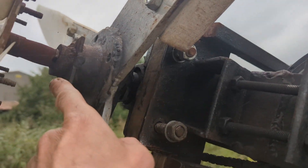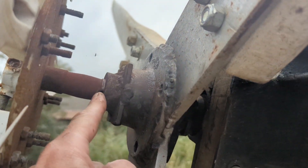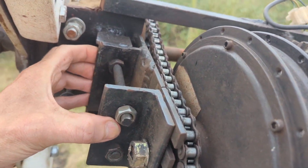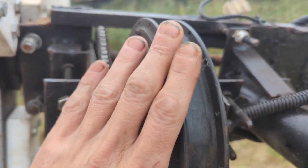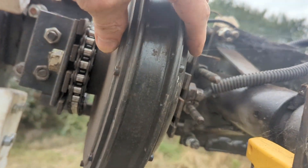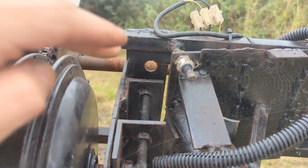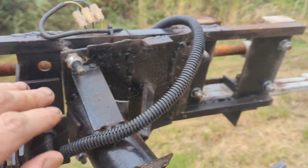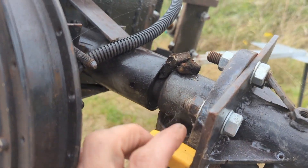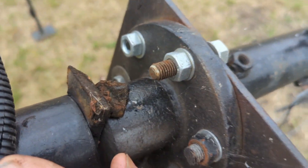This is the axle spindle, and on the front and back I've got those collars welded on. This is the device used to raise and lower the motor, which is here — what an absolute beast this thing has been. That's just a bog standard one kilowatt motor and it's not even very wide. There's the motor frame adjustment thing — I made this from scratch. It just fits over the top. I needed that because the bit which makes the turbine swivel came off a Chinese turbine — you can see the base there with the bolts.